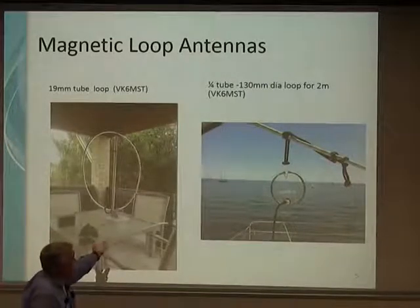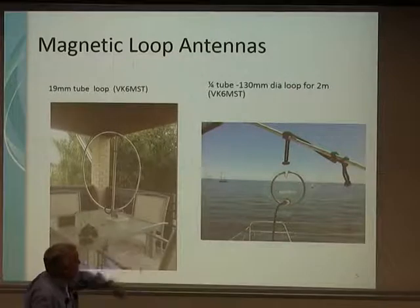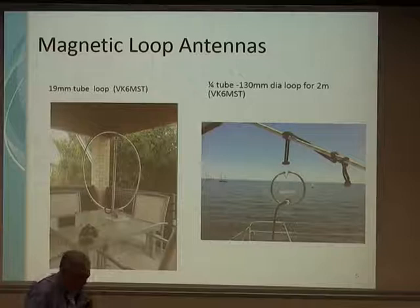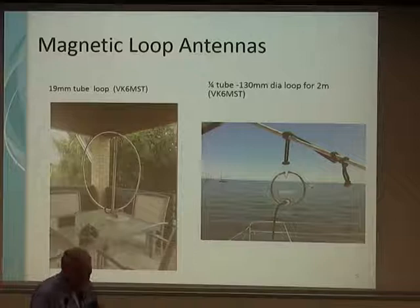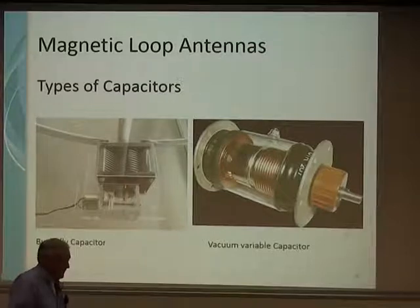This one is on a boat — it's Alan's first effort and he called it the 'FAST loop' because his first callsign started VK6FAST. He used that to talk on the local repeater as a test. The capacitor is so important — the vacuum cap is very good at handling very high power and high voltages. The only drawback with the vacuum cap is it's fragile, like having an egg mounted on top of your antenna, and you can't have any accidents. I had a 3000pF vacuum cap on top of a loop and transmitted on 160 metres with it — it was so sharp that my audio was compressed, but it did actually work with a range of about 100 kilometres.